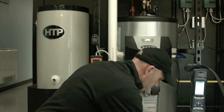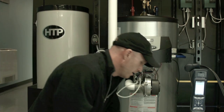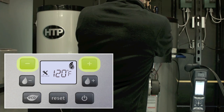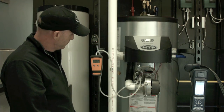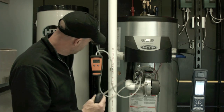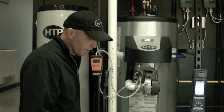To make adjustments, you'll need a couple of Torx wrenches. The throttle adjustment uses a Torx 25, and the offset uses a Torx 40. I have those all set up, my manometers on and zeroed out. I'm going to get this thing on and into service mode — holding the minus and the plus together — it's going to put it in ignition and light it up. I'll take a look at my pressure drop. Now it's going to go up to high fire. We'll give it a few seconds to make sure we've established a good flame, and then we can get the analyzer inside and start doing some sampling. I'm looking at my gas pressure in high fire — still sitting at about 7.1. I'll get this analyzer set in there, hit the back wall, get it in the middle of the stream, and we can begin to sample.